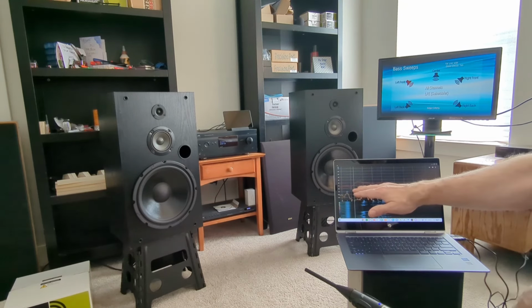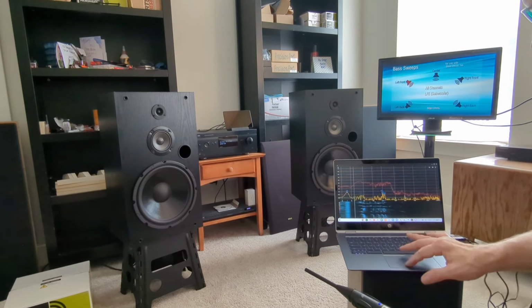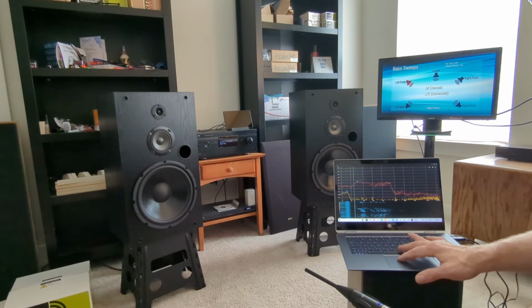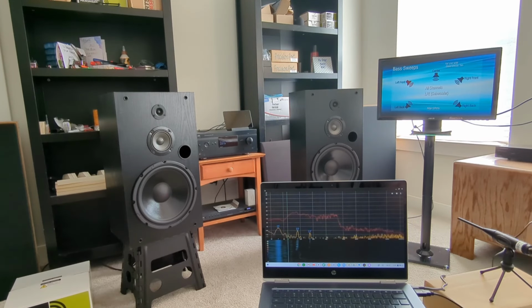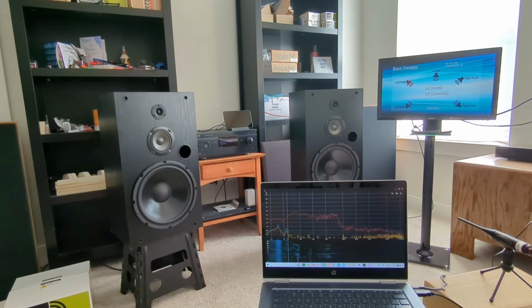However, on the upside, I'm not sure if it killed any of this or not. We can compare it and see. We can see at 100, we're still essentially at our reference line. It's very similar, with the exception that we're not making it to 40 hertz or 50 hertz anymore, like in that cabinet. Just for kicks, I'll run that one next so you can see the difference side by side. I'd encourage you to watch this area right in here when I run that right speaker, because that one doesn't have any insulation in it.